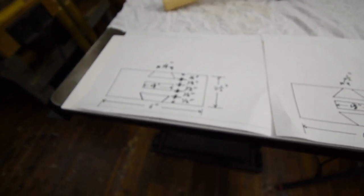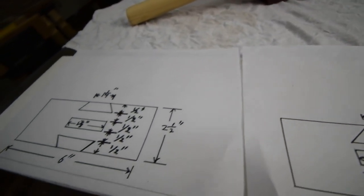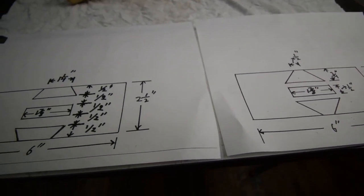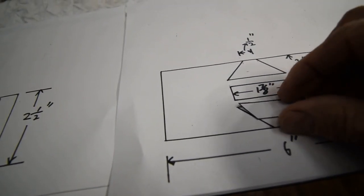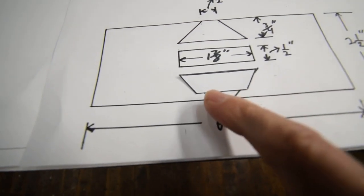All right, let's discuss the design layout. Now, for aesthetic reasons, I wanted to end up with a tenon that was 1/2 inch on the bottom and 1¼ inches on top. I wanted to go 1/2 inch thick by 3/4 inch thick. Now, by choosing to work this way to a set of dimensions, not taking into effect any of the angles, what you end up with is what I've already shown you. If you take the top of the tenon, as I've already shown, and you lay it out at the bottom of the tenon, the two little corners stick over and you've got a notch for them.